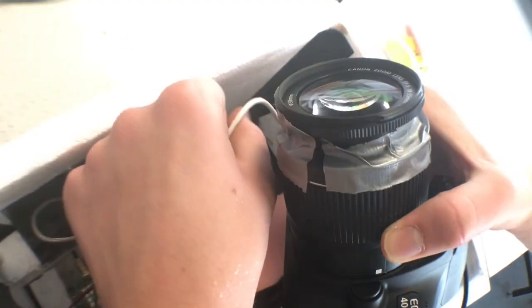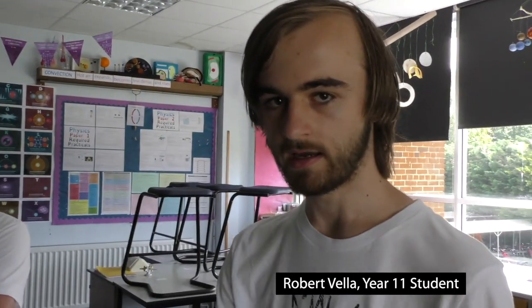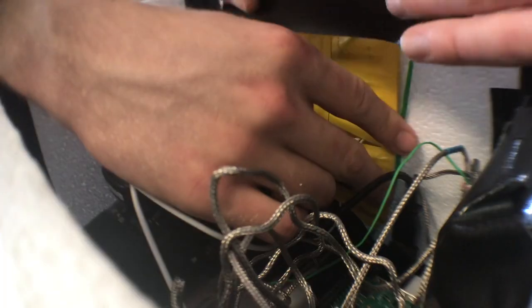Right, so the DSLR is going to go here — this is the cut-out for the lens. This is our 360 camera, which is dangling from here, and what we'll be able to do when we get the footage back is look up and see our balloon burst. This 360 camera wasn't in the original idea. We found that the battery life is only about 1,000 milliamp hours, only enough for about an hour and a half's flight — not enough for the full flight up and down. We had to find a solution, which led me to building this charging circuit to rectify that.